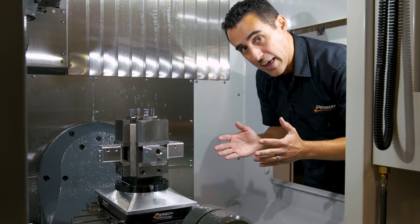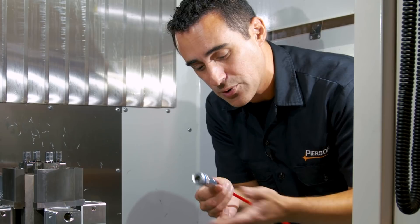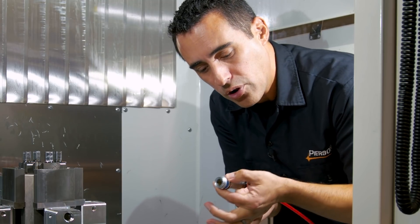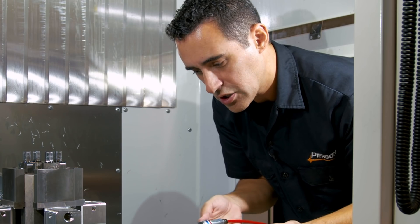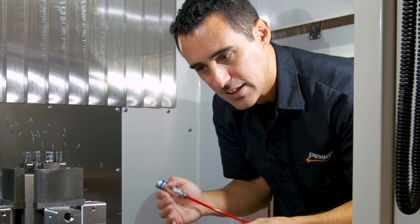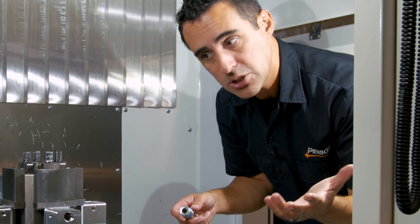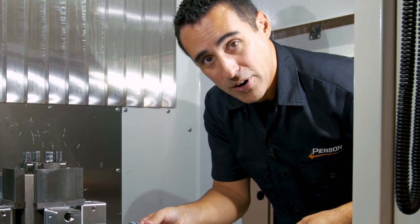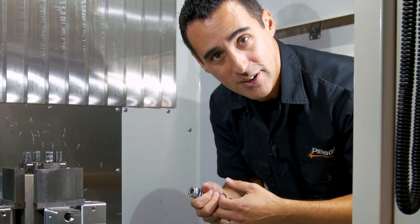The way we get around that is to use a quick disconnect. This is a Japanese style quick disconnect fitting — one-handed operation. Simply push it on and it locks; pull on the collar and it disconnects. It provides compressed air so you can take pallets on and off, then just pull it out. I like this because it goes through the door. If we had a solenoid system controlled by G-code that's fine, but there will always be a manual override outside the machine. You do not want to run these with air pressure applied. If it's plugged in and an operator forgets, they will not be able to close the door and press cycle start. Off means locked — press cycle start and you're ready to go.